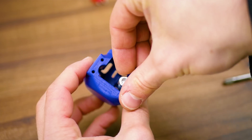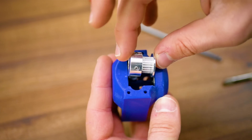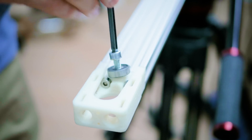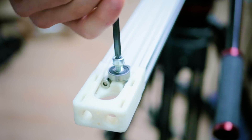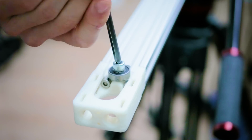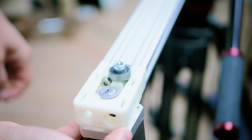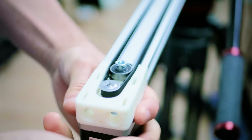So let's build this thing! Starting at the ends, the bearings at the idler side are simply pressed in — if necessary with a bit of heat — and the piece of 8mm rod gets fixed in place with the pulley's screws. The extra bearing also simply gets screwed down with an M6 screw, as the printed parts already come with the proper relief cuts on the back, but do need the thread tapped by hand. If you don't have a matching tap, you can also just heat up a screw and use that to form the thread. On the other side, you have the pulley on the motor itself, which needs to line up with the bearing, and then the motor gets clamped down with long M3 screws.